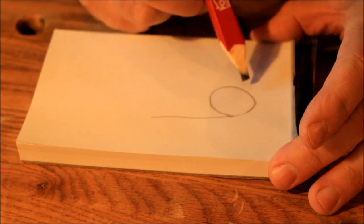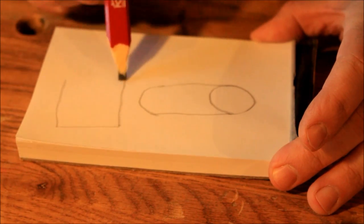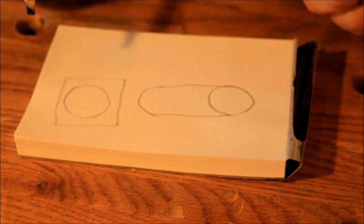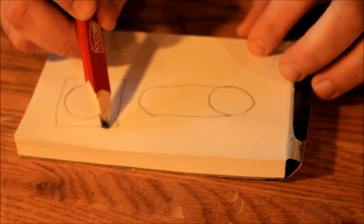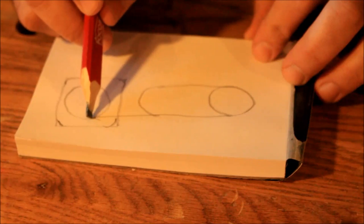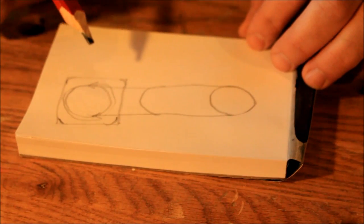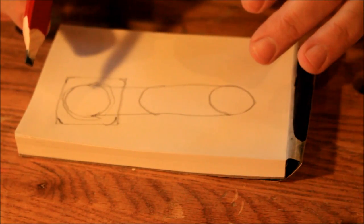The aluminum pipe is welded onto a flange, and with my day job, it makes it easy for me to get this part together because I'm in the welding trade. So this was fairly easy for me and fairly inexpensive as well. I rounded up the corners, so it was easier to match up with the inside of the two parts of MDF. Basically, this is fitted to the flange and welded all around, and that gives me a lot of strength to the actual piece.